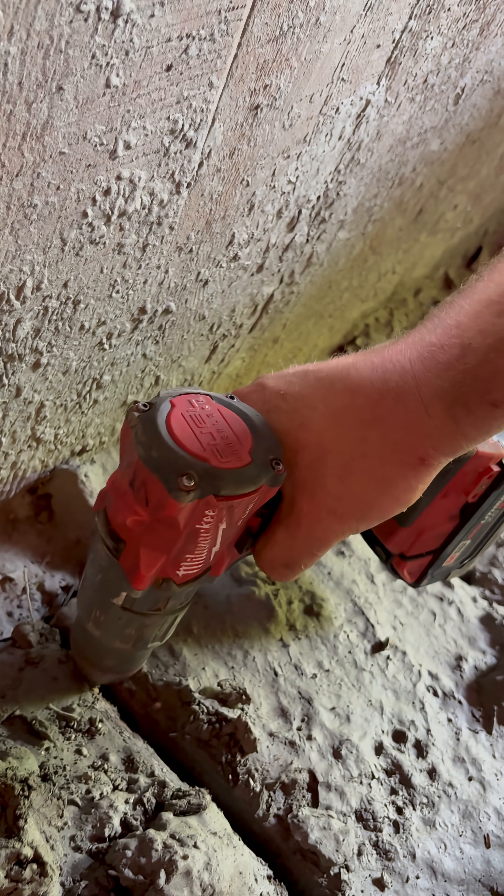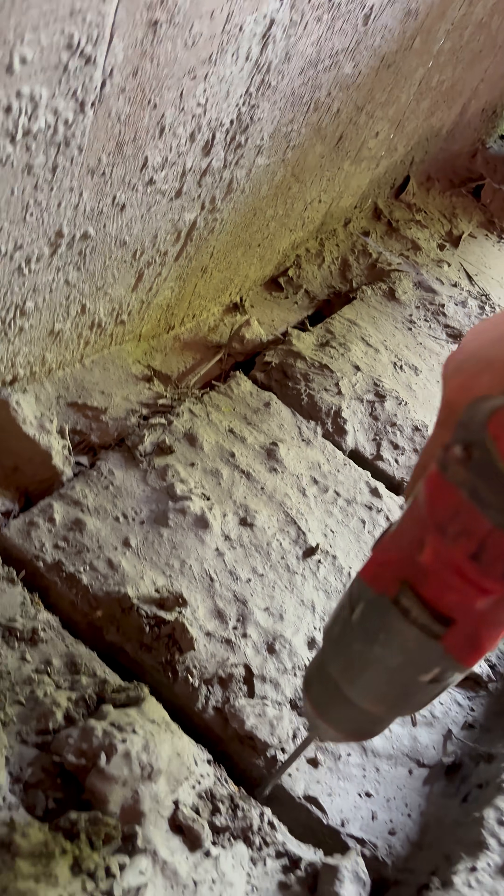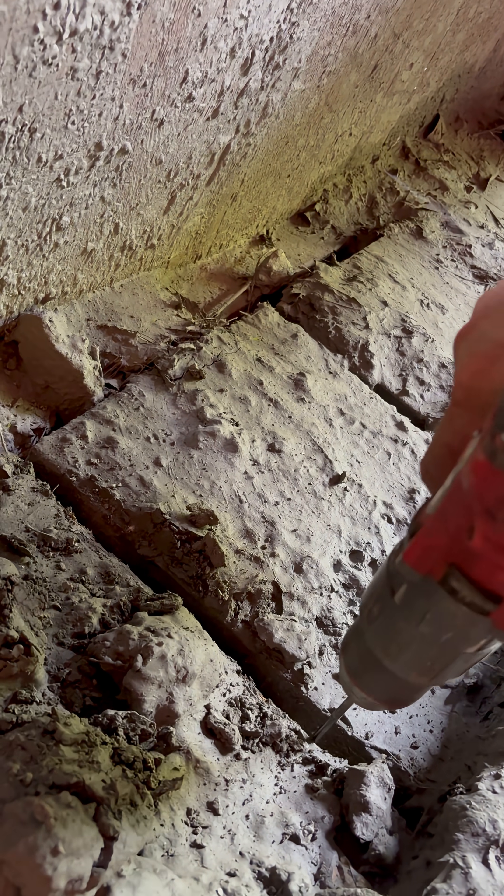Between five and six floorboards back from the queen post, we push the drill down — it's so rotten that the drill just sinks right into it. The inner one has a little more meat, but it's still going several inches in, whereas the outer one there's really nothing there. And you can see, this is the bottom chord right there, and I'm pushing right into it without even turning the drill on, which tells you how rotten this is.